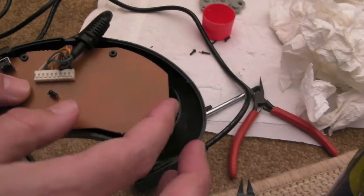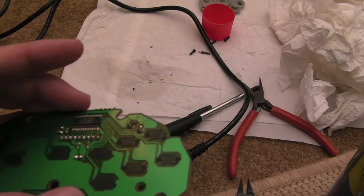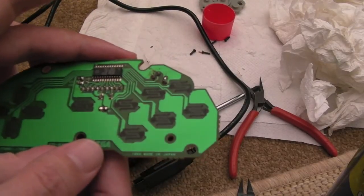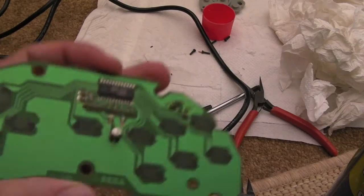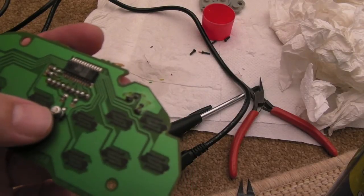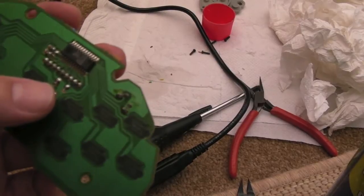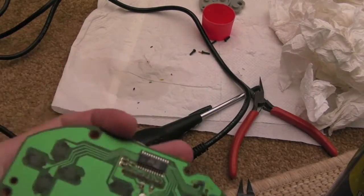One final note with these Sega Mega Drive 6-button controllers — you'll see there are two different variations in how these have been manufactured. There's one component change between different revisions of the board, and that's the capacitor. Where you've got a nice little wet electrolytic, no problems — you can leave that in place, it's not that essential anyway. I think it's just a smoothing cap connected to the plus 5 and ground. But on the other board revision you'll see it's a little surface mount package. It may well be worth replacing that if you've got problems with your controller — it's something like 1 microfarad 50 volts. To be honest, these controllers all work and there's no signs of leakage, so I'm going to leave them for now. In years to come that might cause a problem — you might find a controller just glitches every now and again.